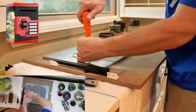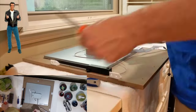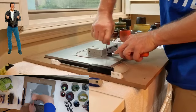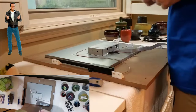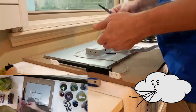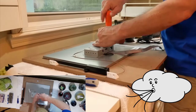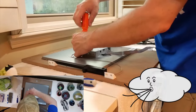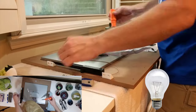This mod isn't a new idea, as many other modders do this to help keep cabs and pinball units as cool as possible. If you're not familiar with the concept, the idea is to continue to use all the parts, but mount the PCB to the outside of the PCB case, and then mount the case back to the monitor. This action lets us increase the airflow to the PCB and removes the PCB from any heat that could come from the monitor. I've also seen other modders add fans to the back of the cab to really increase the airflow. That's not a bad idea at all. However, for today's mod, I'll just be moving the PCB.